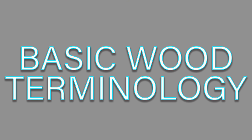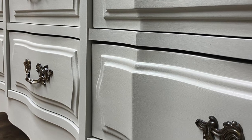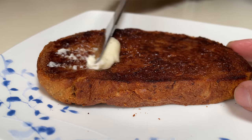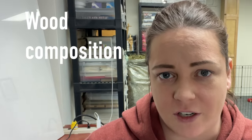In the case of wood veneer pieces, we don't even get to see the end grain, and even on solid wood pieces the end grain is usually obscured by stains and finishes. End grain is usually the best way to tell what a certain wood is, but we don't always have that luxury. Older pieces also have a higher chance of having been refinished at some point, meaning the color you see might be a stain and not the natural color, which can make identifying difficult. But before we get into actual species, there's some basic terminology to cover.